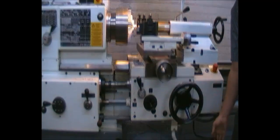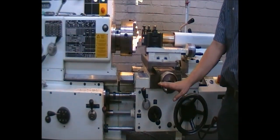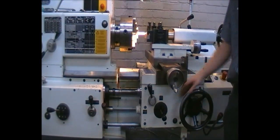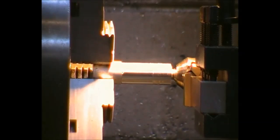Stop, turn off the rotation of the machine, extract the X-axis and move back to your original position. As can be seen in the part that we have just lathed, the surface finish looks good. If there is a poor surface finish, this might be due to the wrong rotational speed or wrong feed being used. Please ask the instructors to assist you.